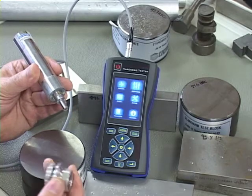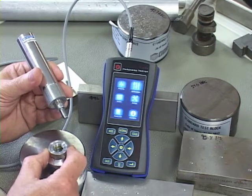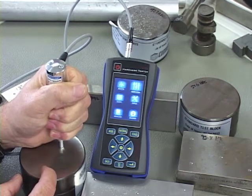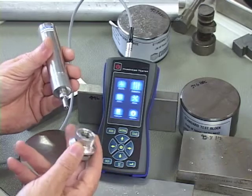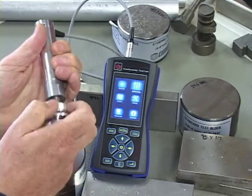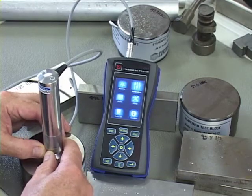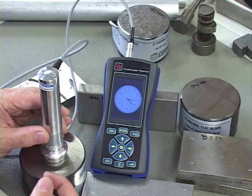There are actually two parts to doing a test, though it's all one fluid motion. The first is the resistance of the spring in the puck as you press down, and the second resistance is when the diamond tip contacts the part — a very short second motion to bottom out on the face of the probe itself. For a new user it's much easier to use it with the puck attached, though an experienced user can leave it off. The motion for testing is: press down initially to overcome the spring resistance, the diamond tip makes contact, and the second motion bottoms the puck out on the face of the shroud — and the test is done.